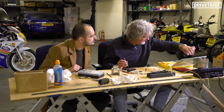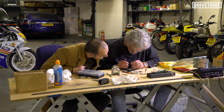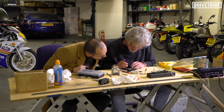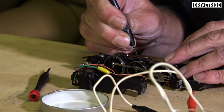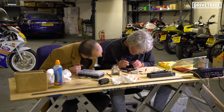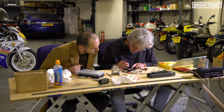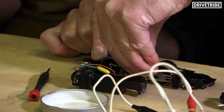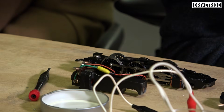because I can't see this. Oh, that tiny little screw in there. Yeah. So what are you doing here exactly? I'm just trying to move the pinion along the shaft by a tiny fraction of a millimeter, so it's closer to the center of the worm, giving it a little bit of clearance there. But it's been on there a very long time. If I put something very thin behind it, like the little knife blade.